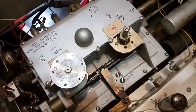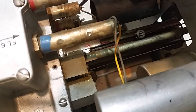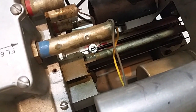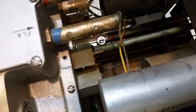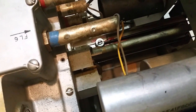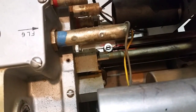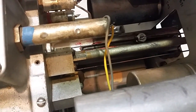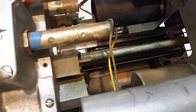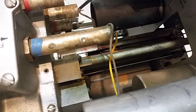The other thing I talked about in the first video was the way they handle the attenuator. Down in here, if you see that upper right-hand corner, you see that moving — I'm turning the front attenuator dial now. To the left here is the output of the amplifier, the stage we just peaked. The sensor head is basically as close as it gets, and attenuation is as low as it gets for the signal source. As I increase attenuation, the signal head actually moves back down that slotted shaft and gets further and further away. This is the signal head up in here right now, coming out of the front of the slot. As that gets further away, attenuation is increased and the signal gets weaker and weaker.